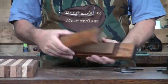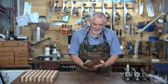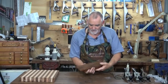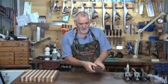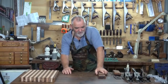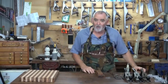This is just a little box I made up ages ago. It's got a Norton stone - I think they termed it as fine, and it works absolutely wonderfully. You can get coarse ones but the one I bought was fine. Another little trick: if you're going to use a wooden stand like this, get some small brads or little nails, nail them into the edge on the underside of your box, and when you put it on your bench and push down it will stay there and won't move. So put little nails in there, snip them off with a pair of snips, and it's a nice little bench hold-all device.